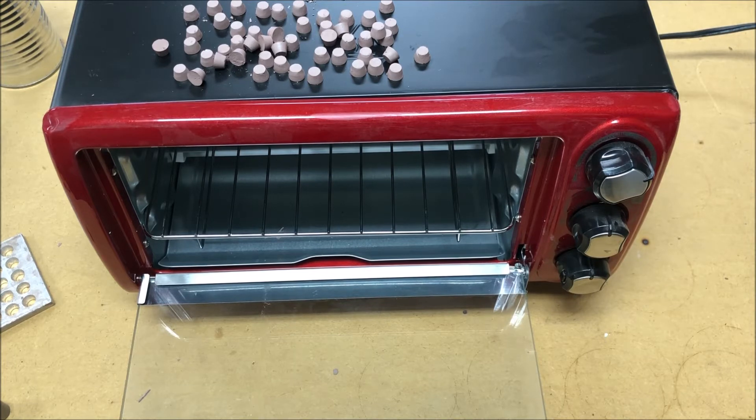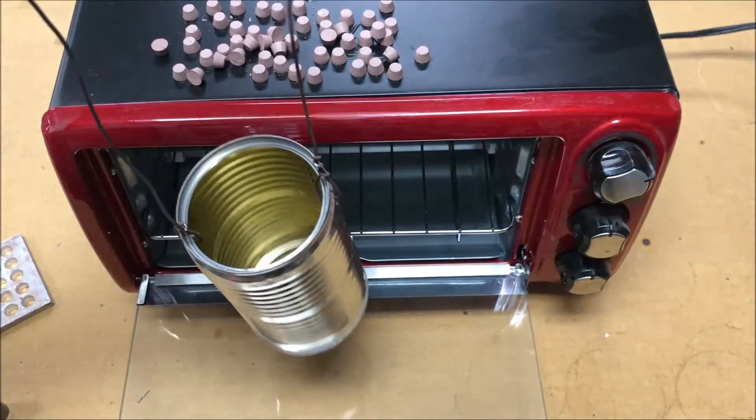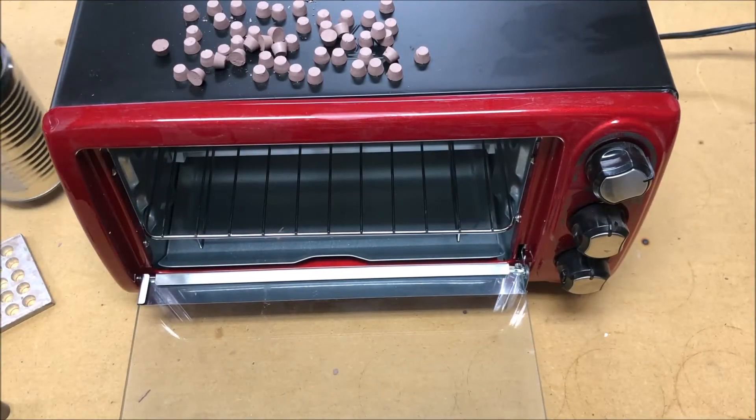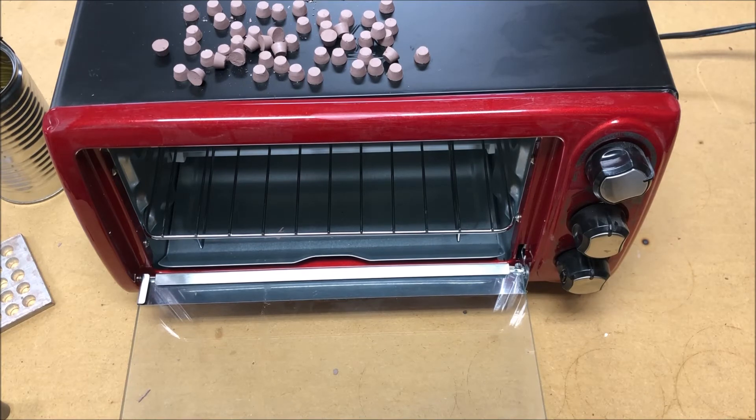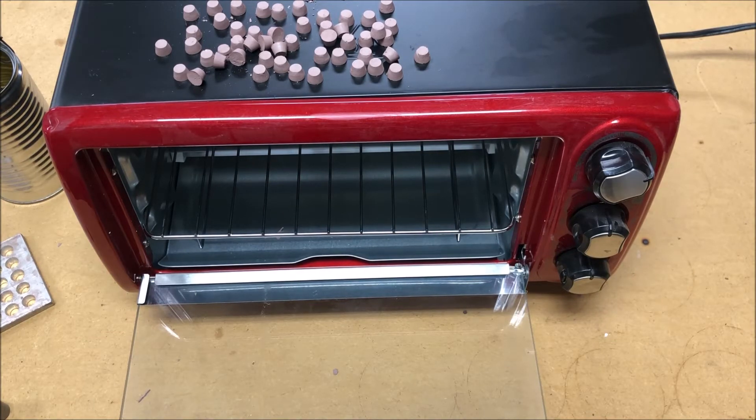So next, now that we've got some plugs that are somewhat dry, I'm going to try to fire them in my furnace. It's called a cowboy furnace, and I've made a little bucket using a soup can to hold the plugs. This clay is cone 06, so it should fire at about a thousand degrees. This furnace gets up considerably hotter than that — it's designed for melting brass, which is why I bought it to get into brass casting. Now I use it mostly for melting down 60-pound pigs of lead into ingots.